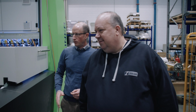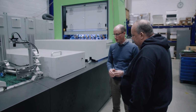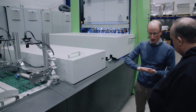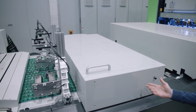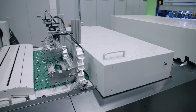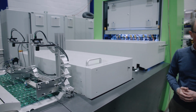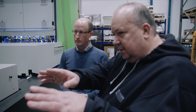Okay, yeah. And then we have, what's that? We have an option for IR lamps. If you just print very thin layers, like 4, 5, 6 microns, then you can increase the gloss level a lot with this. So what you're saying is an IR dryer, which is infrared and is heat. When you use that before it's cured, you get a more glossy surface. Correct. Yeah. So this is the super gloss unit, right?